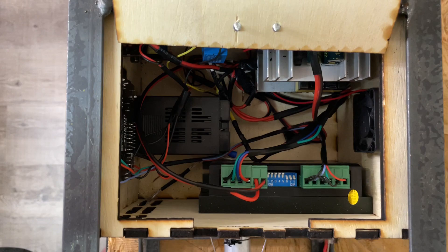But how does it work? It all starts with the electronics. The incoming 120 volts AC gets diverted to a 24-volt power supply, a temperature controller, a 5-volt DC wall wart PCB, and a relay. The power supply powers the stepper motor and electronics fan, and the relay feeds power to the heating bands and is controlled by the temperature controller.